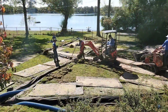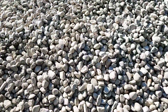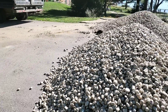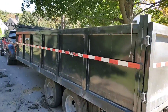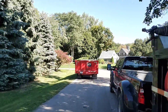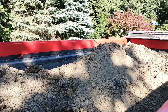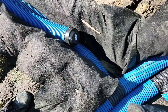We're going to give that water a place to go. When it hits the veins of stone, it's going to fill the voids of the stone and find its way to the void of the pipe. We have three perforated pipes in each trench — two at the bottom and one on top — creating as much void as possible. The slope of the yard carries the system, so we didn't have to build in any slope. It's going to drain down to our discharge line that runs to the lake. We're removing all the dirt and not putting any back, because we want the water to find the voids and run through the stone into the pipe.